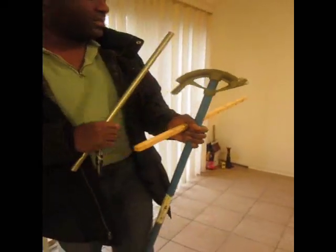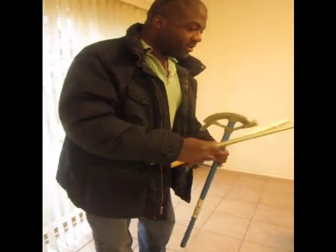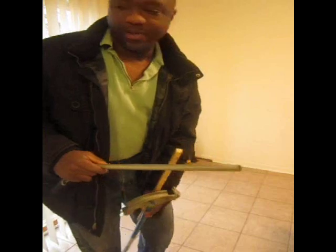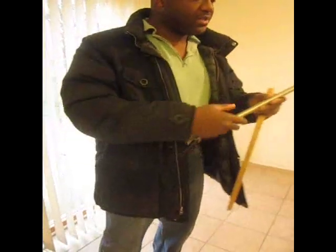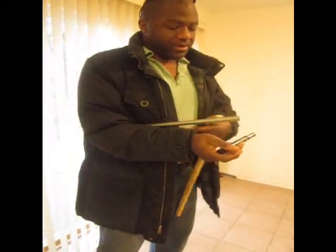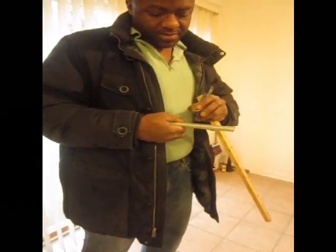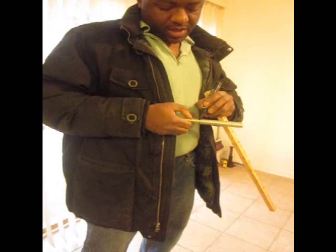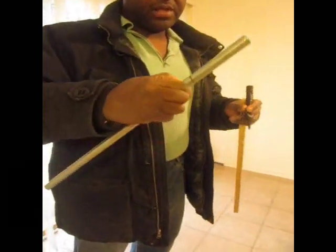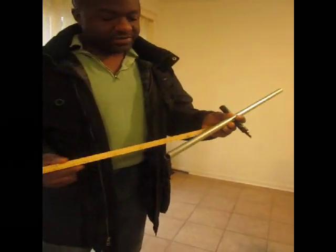The offset ruler has a similar thing. What this is going to do is — say you want your offset to start on the pipe somewhere around here. So I'm going to make a mark right there on the pipe and make it go all the way around the pipe. That's where I want the offset to start. Say I want to make a three-inch offset.